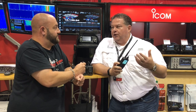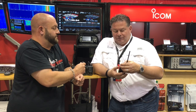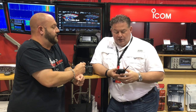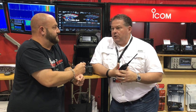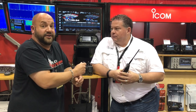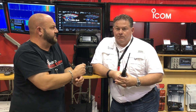Any radio with a soft button will have the processor still running at a low cycle to sense power on. The only way to get away from that is to have the tactile click on the battery. We've had it on here at the show yesterday and today showing everybody, and the battery is still going — we just had to plug it in before filming. So a couple of days of standby and use would be a pretty realistic estimate.